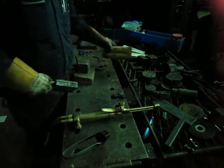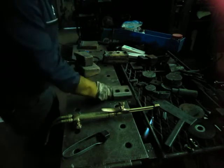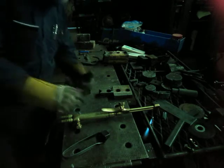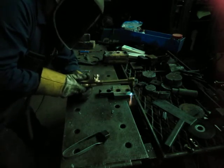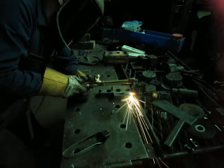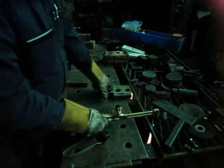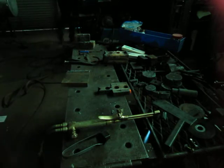Now here is a piece of 1 inch — we will attempt it with the same setup. This is kind of pushing things; 40 psi is a little low for a 1 inch plate in my opinion. Notice how I didn't get full penetration. Just not enough oxygen pressure. Let's go up to 60 and see what happens.